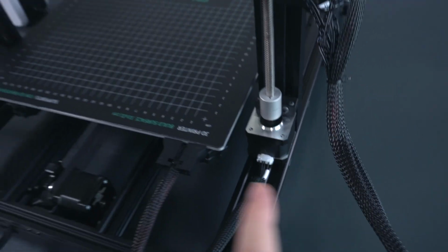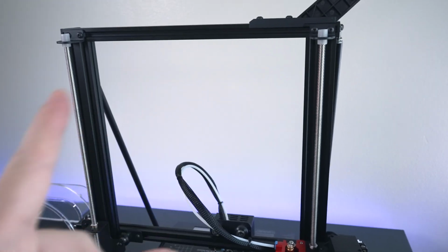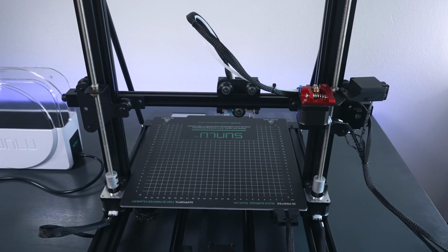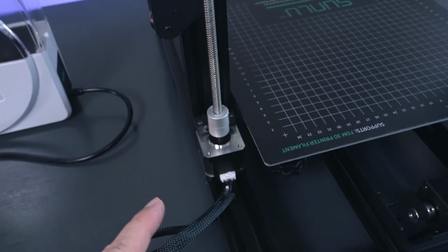And speaking about the Z-axis, guys, they are not tethered together or synchronized. Both of the motors have to move at the same time as you go up and down, or, you know, it could skew a little bit back and forth. But we'll see that once we print something spiralized, all the way up. But yeah, we pretty much got the same thing here on the other side.